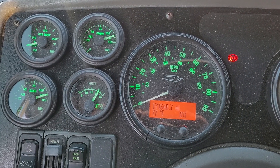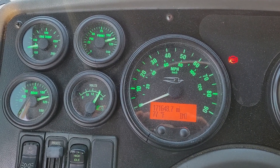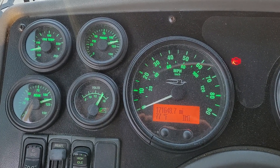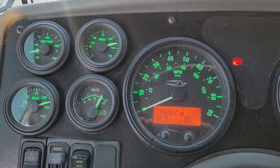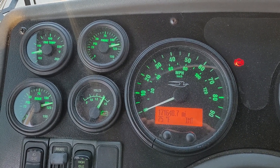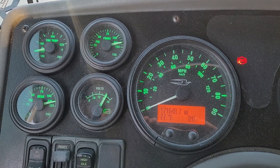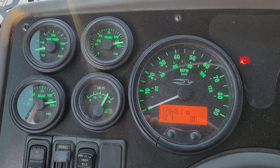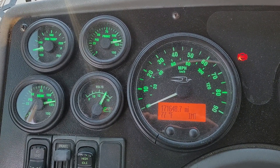I get the question a lot: why do we drain the air tanks? All of our electric buses have a switch inside; our CNG buses have a valve outside — I'll show the outside valve after we're done with this. With a dual air system, the front tank takes care of the back and the back tank takes care of the front. Right now we're going to open up the front valve — assistant, please.